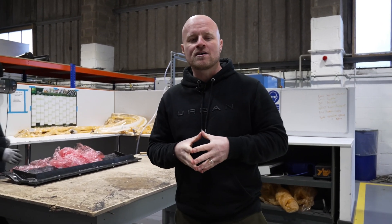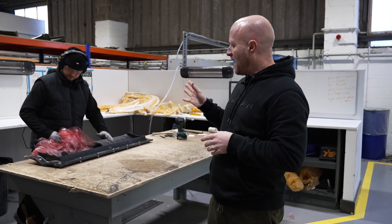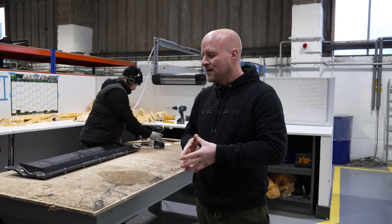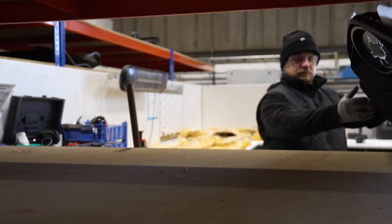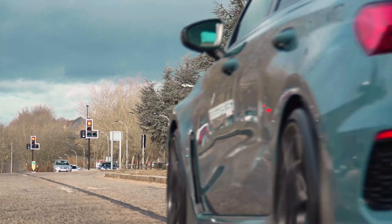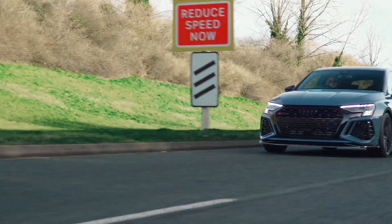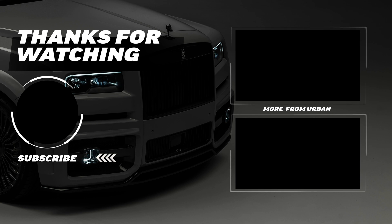This is breaking out, or demoulding, the component from the mold. It's come out of the autoclave in a cured state. There's an art to this — you have to be quite aggressive to get the component out with no damage. As you can see Thomas is doing here, this is the glory moment for any laminator. They love to come and see, especially their first off-part coming out of the R&D process. And there it is.